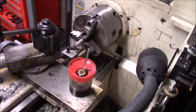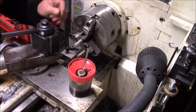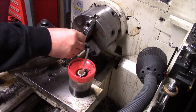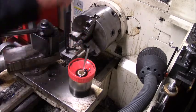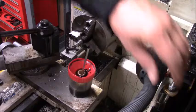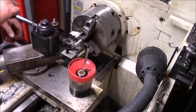I don't know how much you can see here, but I've cut somewhat of an angle. I'm more or less looking for clearance here. So when I go in to cut it off, I'm going to have a flat, and that's how I'll place the flat right there in it. I'm leaving material, then I'm going to cut a chamfer on the end for the threads and go get the die and set it up.